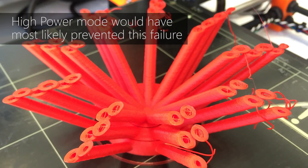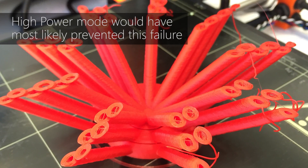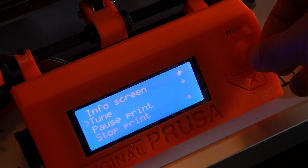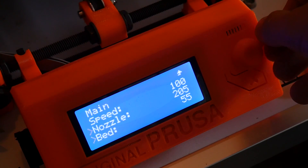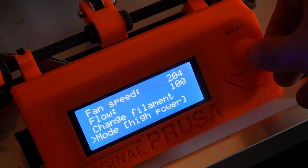The printer has two power modes — silent and power — and they really do match their descriptions. I actually slept in the same room with this machine running in silent mode on a carpet, though I would not recommend that. In high power mode you can definitely hear it through the whole house — it's very, very loud. Running in silent works most of the time, but if your print is suffering from that curling issue, you're more likely to lose steps because you have less torque, so it's a bit of a roll of the dice. You can however change the mode during the print, as well as all your other parameters like temperatures, flow speeds, and flow rates, which is very much appreciated.